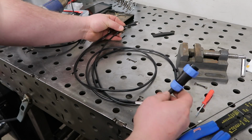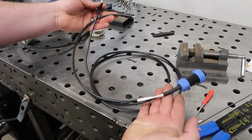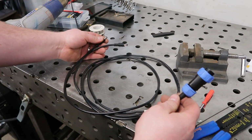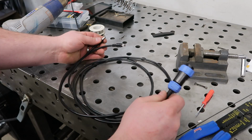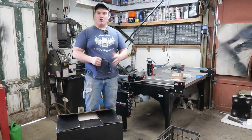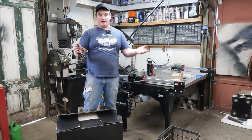You should have your DVI pigtail and your torch firing pigtail both coming out. Torch firing pigtail should be on pin 1 and 2, and your voltage dividing pigtail should be on port 4 and 6.